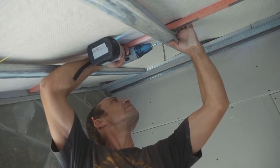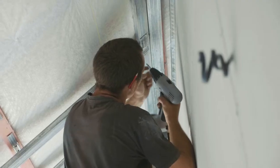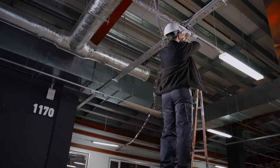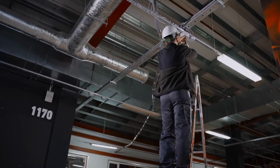The way it works is that the electrical runs in your attic usually have room for some movement. You can expand this by removing a few of the staples that connect the electrical cable to the framing. After, make sure to re-secure the cable with staples once again after you have moved the fixture.